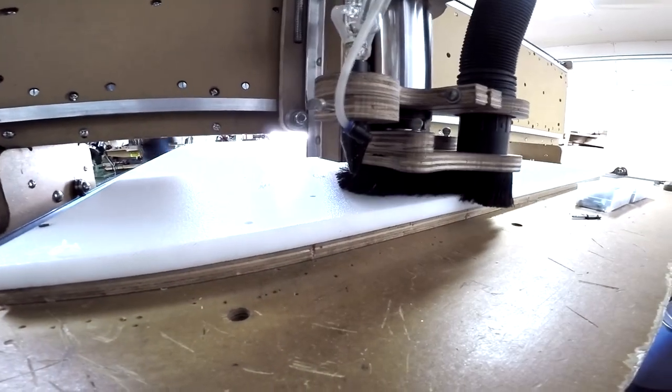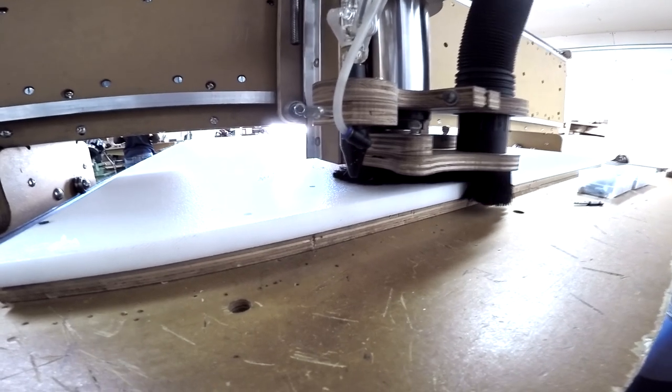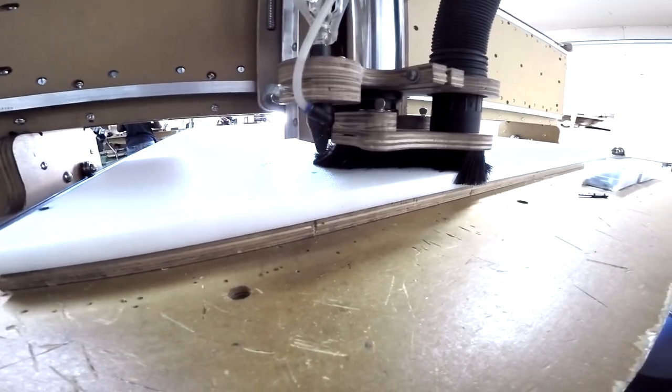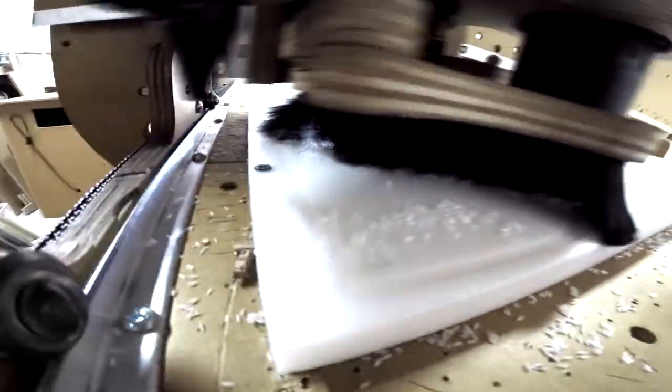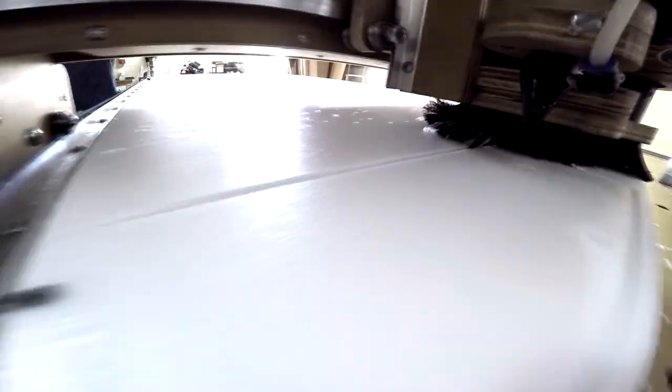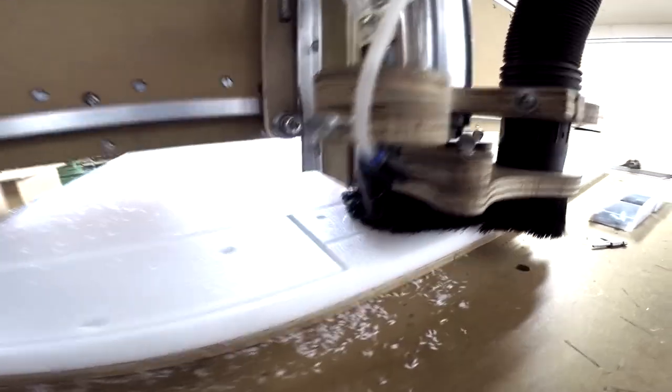Having it in a very cold environment is going to cause some problems because you have wood, which has an extremely low coefficient of linear expansion, and you have the polyurethane coating it, which, relative to the wood, has a very high coefficient of linear expansion. Those two materials together in an environment that cools and then heats could cause problems with the adherence. The polyurethane can crack, allowing moisture to seep into the wood. So he preferred an actual table that was completely plastic, and he preferred HDPE,